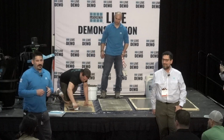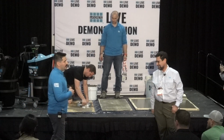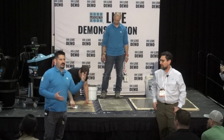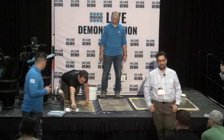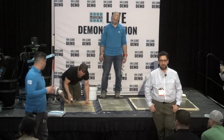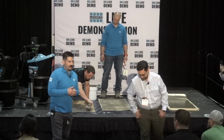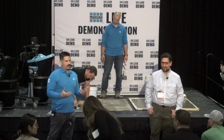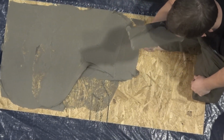And then it was just a testament to the product actually getting around 200 square feet on a rough surface. And when it's semi-flat and not so many divots, we're around 380 square feet at a skim. So extremely effective, nice, creamy consistency. We've worked on this one for an extremely long time, and just the feel of it and everything else that we're trying to achieve, I think it just fits so perfectly well now with Level Plus Light.